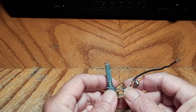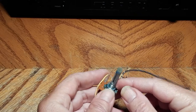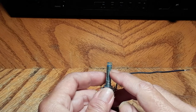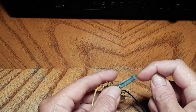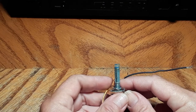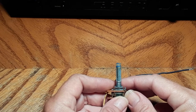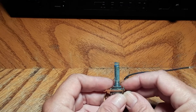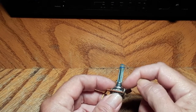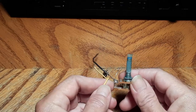I actually did two of these just to prepare myself for the future. Unfortunately this is the one I didn't finish. After I build that up and let that cure for several days, I just notch this part of the shaft out and notch it straight down through, making a half shaft out of it. You've got to have a pair of calipers for this — it's a whole long drawn-out process. It's got to be pretty much exactly right, and you've got to do a couple dry fits to make sure the bushing for the knob isn't grinding against it. But it works — it goes right in.